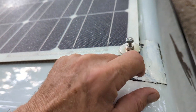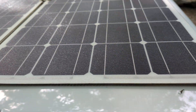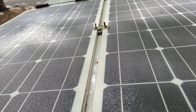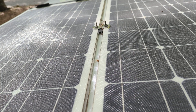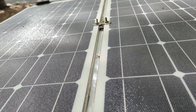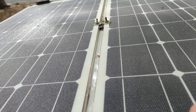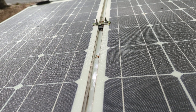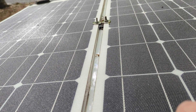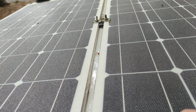I put a little white paint on here just to make it blend in a little bit more. I didn't bother with it back here because you can't see it. These are Renogy panels and I got a Renogy charge controller. When you put in a solar panel system you need the panel to generate electricity and then you need a charge controller to manage that electricity so that you can put it into your battery and not damage your battery.